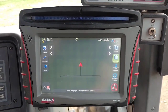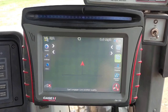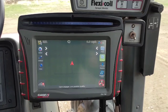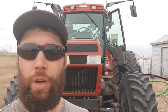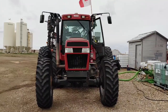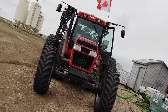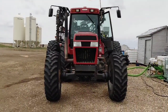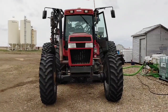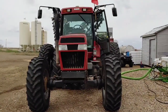Here is our FM 750 GPS interface. This thing talks to the antenna on top of the cab, which talks to satellites to know where exactly it is, and it does all the work of interpreting those signals and figures out where exactly it is on the globe. Once it's figured out where the antenna is sitting on the globe, it has one more quick calculation before that signal is useful to us. If you put the antenna on top of a combine which is 13 foot 6 to the top of the cab, and you tilt it a little bit, that antenna is no longer in the center line of travel - it can be off by a foot or two. If we're trying to be accurate to within about six inches, we need to take that tilt into consideration.